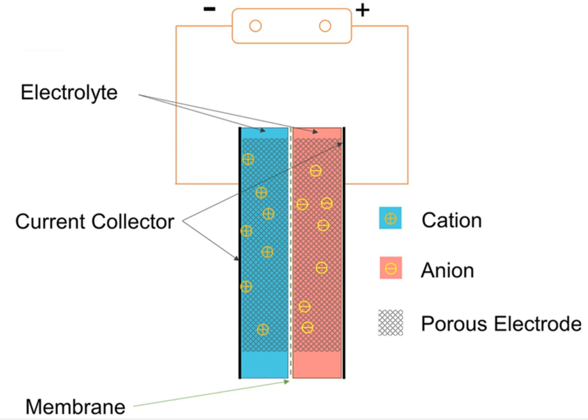A triple hybrid forklift truck uses fuel cells and batteries as primary energy storage and supercapacitors to buffer power peaks by storing braking energy. They provide the forklift with peak power over 30 kilowatts. The triple hybrid system offers over 50% energy savings compared with diesel or fuel cell systems. Supercapacitor-powered terminal tractors transport containers to warehouses. They provide an economical, quiet and pollution-free alternative to diesel terminal tractors.